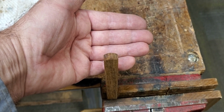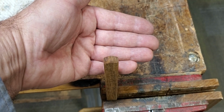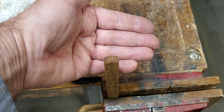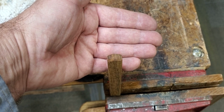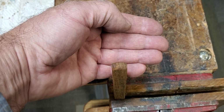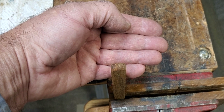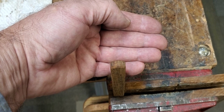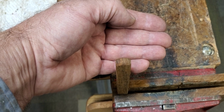When you're making your sleds, make the runners out of quarter sawn material. And just about any board at the store, you can find some quarter sawn way out on the edge of the board. Use that part for the runners, because quarter sawn, like you can see here, though the grain is running 90 degrees, doesn't expand very much when the humidity changes. So that'll make your miter sleds a whole lot better if you do that. Now, let's go look at the brackets and the improvements we made there.